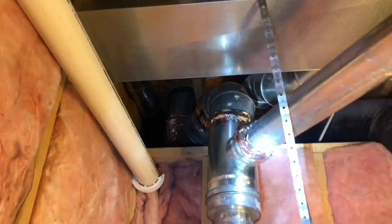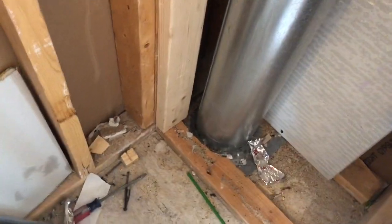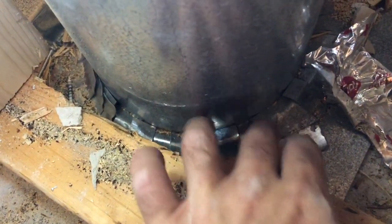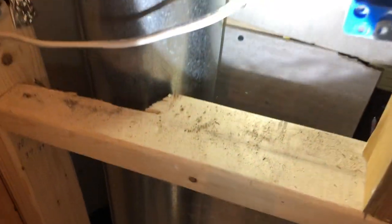I had to lift it up about three inches. Upstairs you've got the B vent coming out of the floor — if you're doing this yourself, make sure it's not touching anything. See this little metal flashing ring with the little ridges on it? What that thing is doing is keeping it away from the wood and centering it. You can see it's got these little flaps everywhere and the wood is probably cut back to about an inch, so as long as you're an inch away you're good.